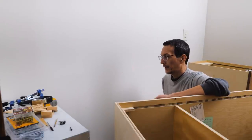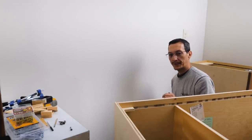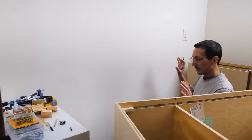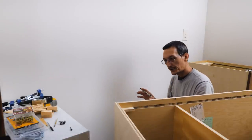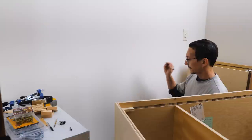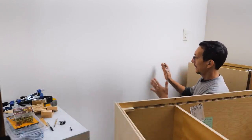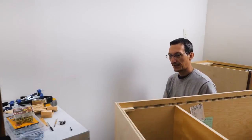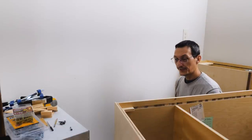I want to clarify how I'm laying all this out — finding center lines, figuring out exactly where the plumbing goes on the cabinet. When laying out a vanity or sink cabinet where you have to drill for plumbing, you want to center it under your window for a kitchen sink, or right at the plumbing for a vanity. First find your center line on your vanity cabinet and then your center line on your wall. You don't want to measure off of anything that moves — you want to use a fixed surface with a fixed line that doesn't move the entire installation.